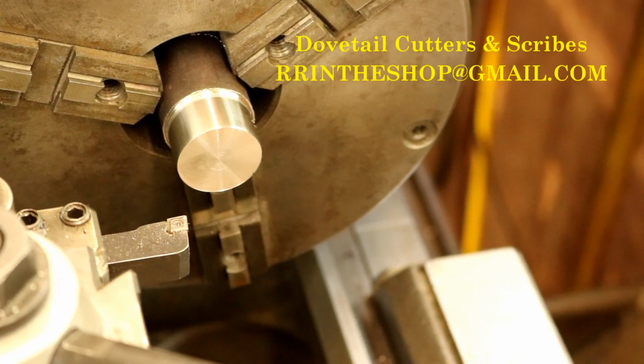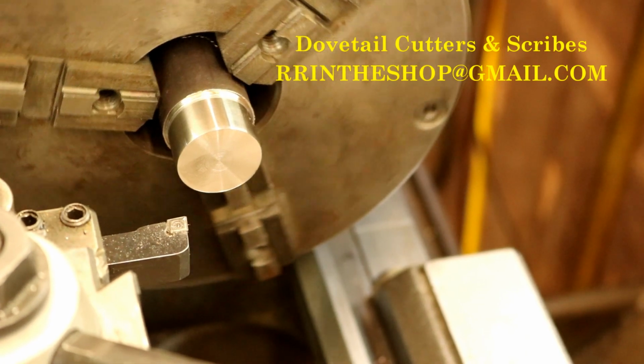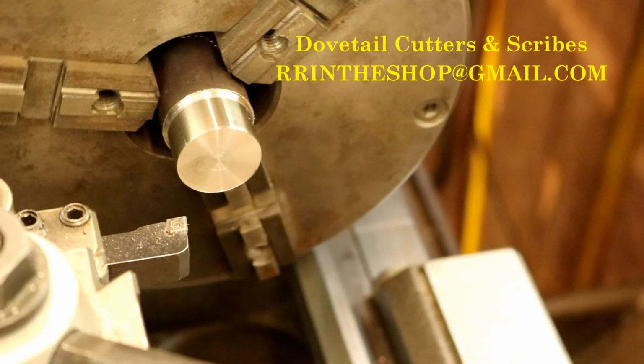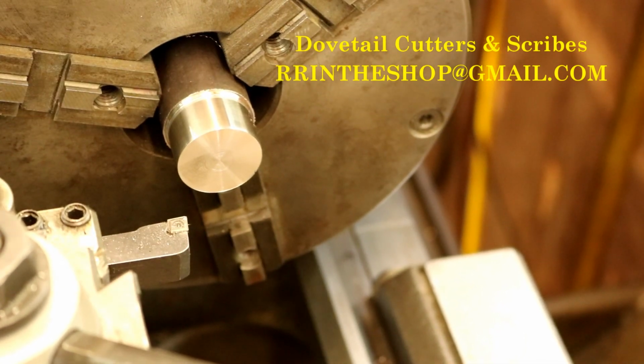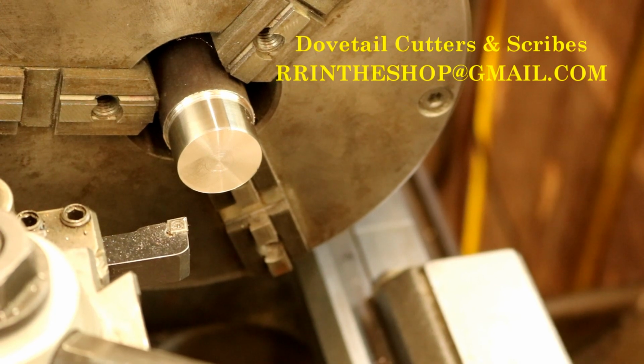Thank you guys, and thanks for watching, and I hope you enjoyed this series. A lot of repairs to the lathe, and I think all the repairs themselves are great and fine. So this is hopefully more of a setup thing. I think the bearings are fine in the machine. There was a lot of end play, and I retightened the bearings.